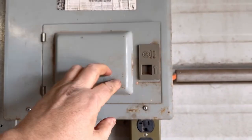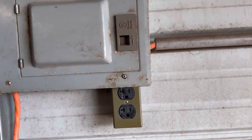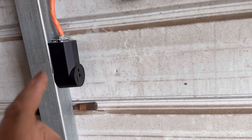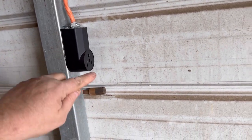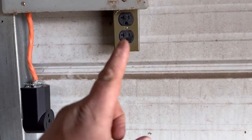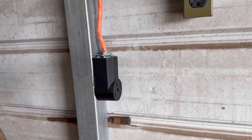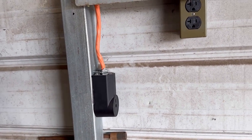She's good to go — this is a GE box, by the way. Another thing you can do: since you've got a heavy-duty 220 plug now, you can buy an adapter that plugs into this to run off of only one leg, so you can have a heavy-duty, extra heavy-duty 110 to run whatever you need. If you've got something with a high draw, you can plug it right into your 220 outlet.